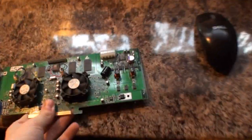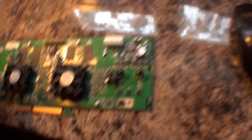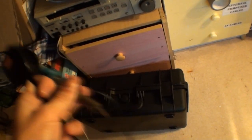I still haven't got around to fixing this graphics card — the capacitor is still sitting on the board unsoldered. The reason I haven't been able to do that is because my soldering iron packed up, and when I attempted to fix it I found that the copper wire used to connect it was so thin it had just snapped. The quality of the cable which links the soldering iron to the mains is just terrible. I'll have to get a new soldering iron at some point, but I'm not too worried — I've had it over a year and it only cost about a fiver.